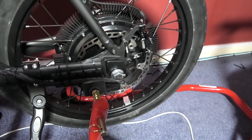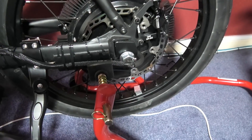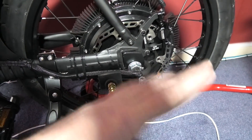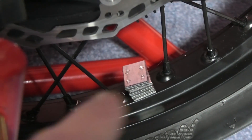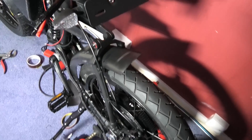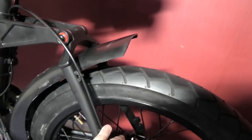That's how much weight I've had to add. What I've got to do now is take the tyre off without taking the wheel off, because everything's all connected now. Take the tyre off, put the weights on the inside in the valley sort of thing, tape over it, put the tyre back on. I'm going to have to space it out around that area. I'm sorry to those people who liked the mud hugger - I've had to chop it off, I've had no choice. Eight inches comes to about there so it would have actually touched it. It's a lot more sturdy now.